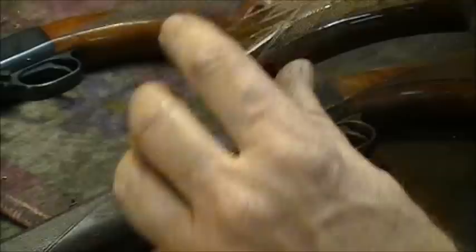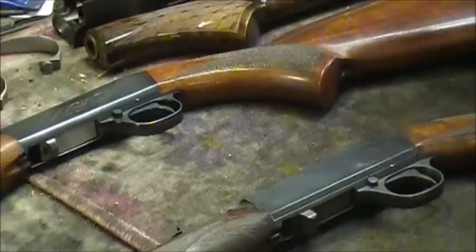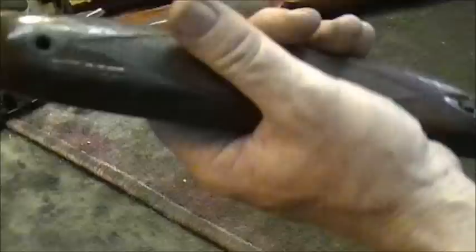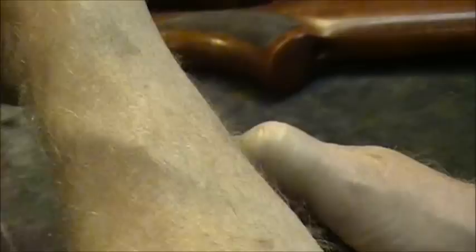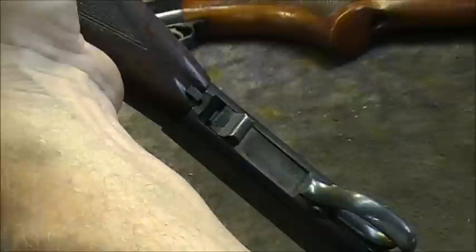But really, there's no reason for that thing to be broken out. And the reason that's broken out, and it's broken out on this side, is when you break these guns down, you take them apart, you turn that barrel a quarter of a turn, and then it removes from the receiver. Well, if you get a real tight one and you get a little bit lazy, the only way to do these properly is to grab that receiver. And when you take that barrel down, of course, what do guys do? To get more leverage, they grab them by the stock. And then what's going to happen there if you got a real tight barrel? Yeah, you get some good leverage. That's true. It helps you torque it out a little easier.